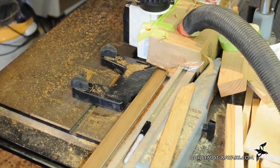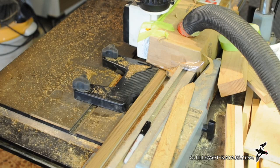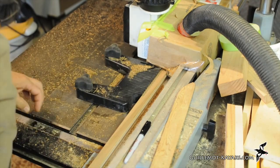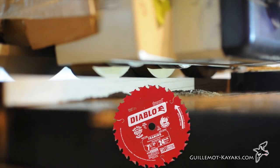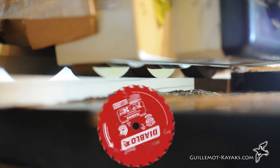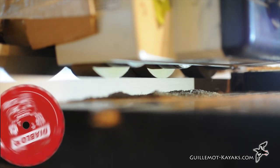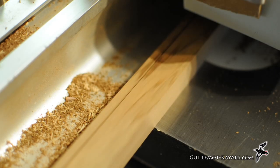This mag switch feather board is great for controlling the ever-narrowing blanks — just unlock and slide it in. The stock feeder does a good job, but the long boards are easily shifted. The feather board keeps everything running straight and true. I use an inexpensive Freud Diablo 7-and-a-quarter inch framing saw blade with 24 teeth. They have a very thin kerf to minimize the material loss to sawdust.